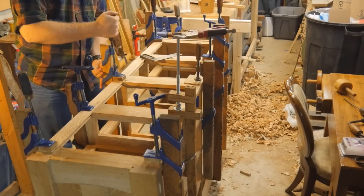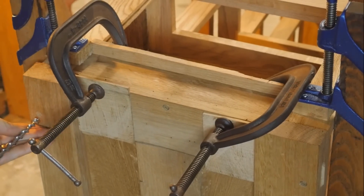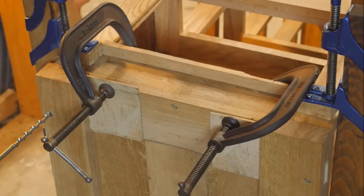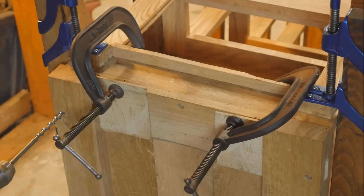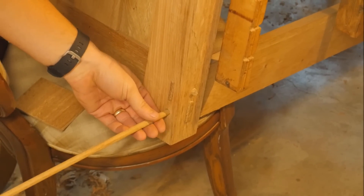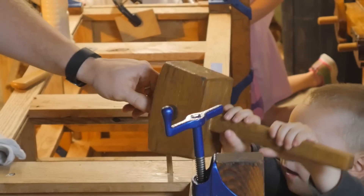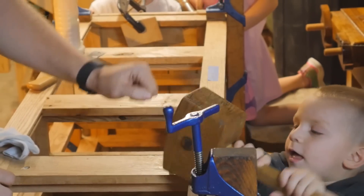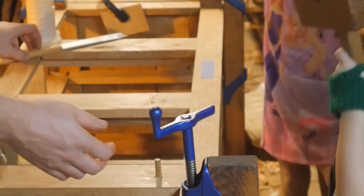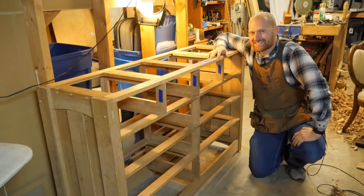Once it is fairly well set, I come in and start putting in the pins that will actually hold this in place. I bore them out and put the pins in those holes. While I was at it, I ran the pins in the tenons as well since I hadn't done those before. I put glue in the hole, drive in the dowel with a little tapping, then cut it off to the appropriate length and move on to the next one. I like to leave them about an eighth inch out if I'm going to be shaping them; the ones on the top get cut flush. I figured this was a good chance to bring the kids in and let them have a little fun. I really need to teach these guys how to swing a mallet — I love working with the kids in the shop.